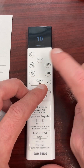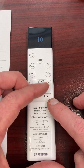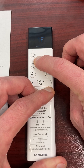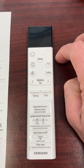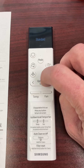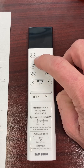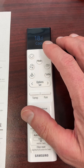To get out of this mode, I don't want to leave the remote in there — we don't want the homeowners getting in there. I'm going to go backwards: temp and fan both down and mode at the same time. I hold those and I should get back to my initial settings. There's the initialization — we know our initial settings are fine, we were on standard Celsius and we're good.